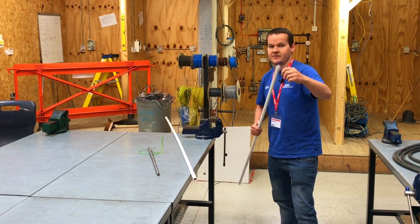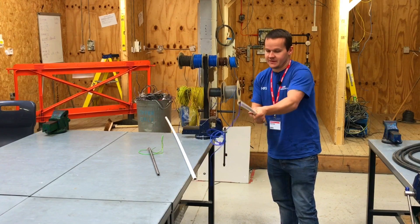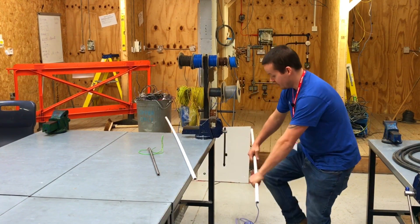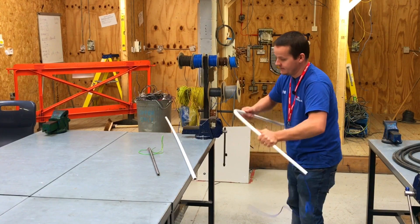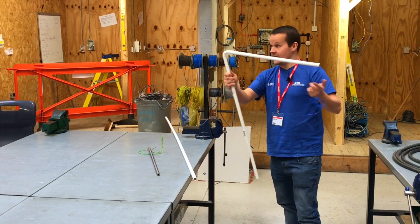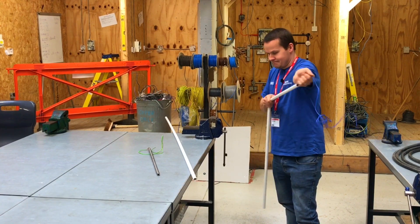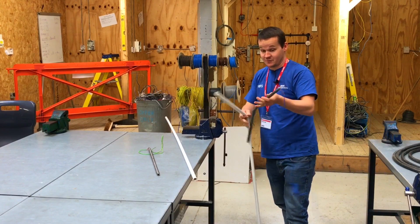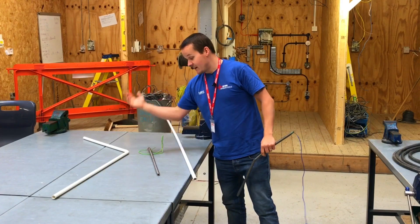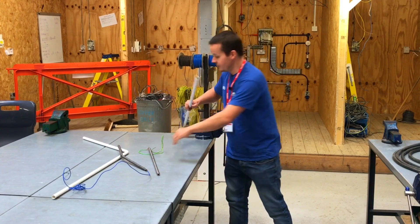So this is the not-so-good conduit. Normally mark it with a pencil so you know exactly where it is. You warm it up, then go on your knee — and straight away you can see exactly what's happened to that conduit. When you go back it's completely jammed, and it will bend your spring. So that is now scrap — you can't use that.